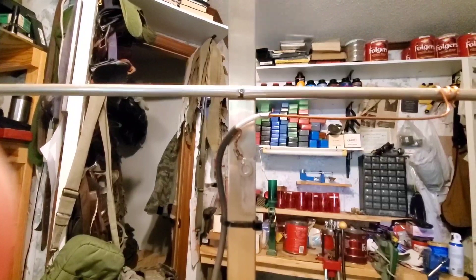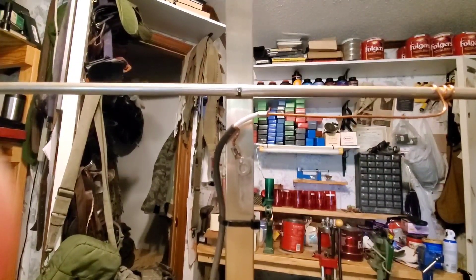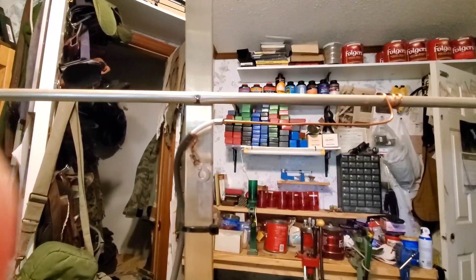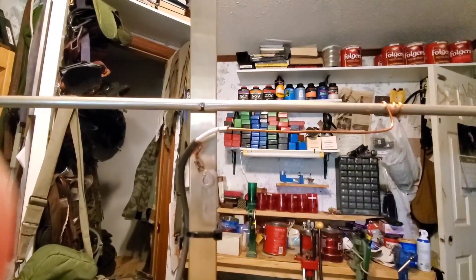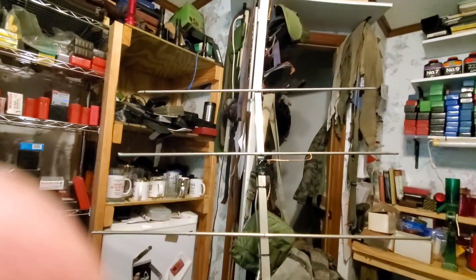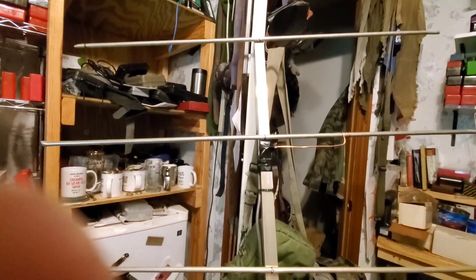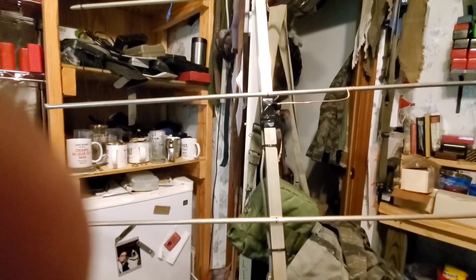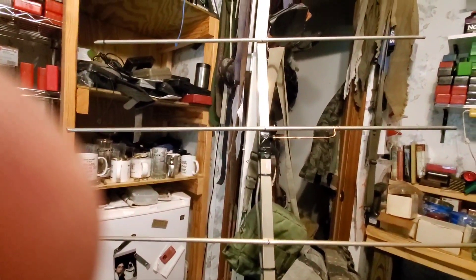Okay, that's the feed line before I tape it up. The braid's attached straight to the boom, the driven element's to the boom, and that little coil is what's going to be the feed point. The center conductor will be taped up to where it doesn't make any contact. We're going to tighten everything up. That's the finished product — we're going to see how it works running that Nano VNA check. I'll have to trim this boom off when I install it on my tower.